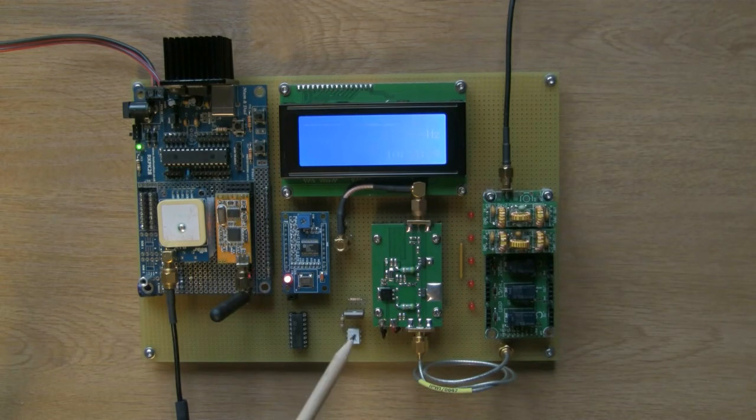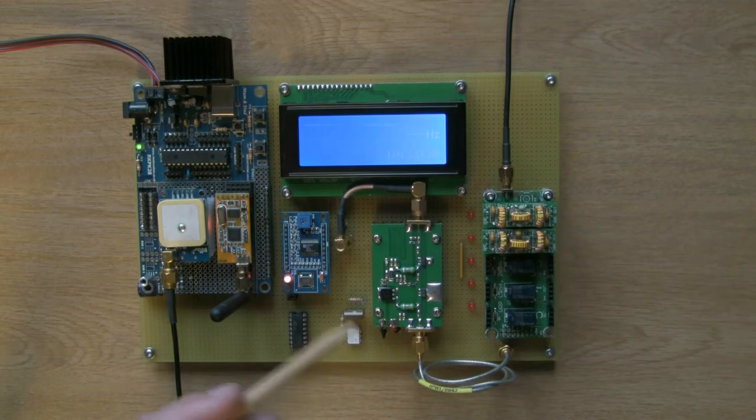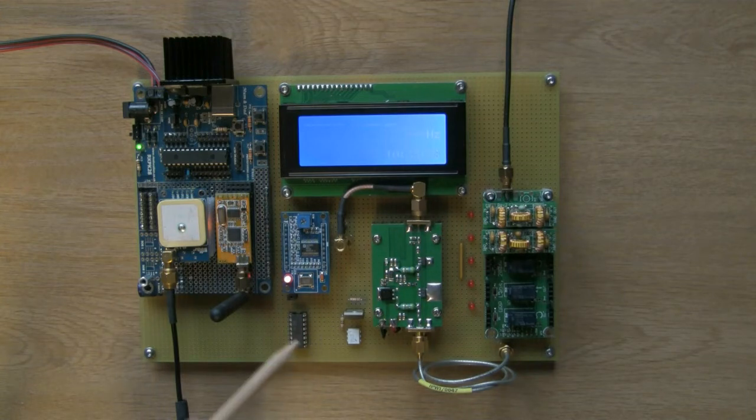I'm getting about 33 dBm out of it, so something like that. A couple of watts around about there, depends on the band. I mean, this is Whisper, so it's not that power dependent. You're not trying to kick out tons of power. You're good on 500 milliwatts. So in fact, you don't want to push too much power in this mode anyway. So these little modules are great for that. Maybe it could do with a little bit more power, but future work.